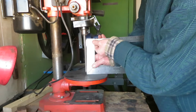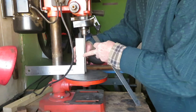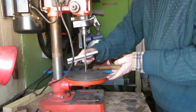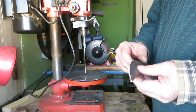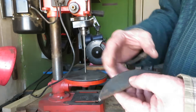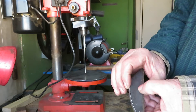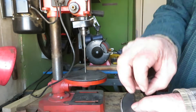We can measure it there and over here — it's 5mm. That's what we need to lift this up to get it perfectly square. That distance is the material we need: 5mm thick to lift it up 5mm. We cut an arc 13cm long and about 3cm wide — wide enough to drill a hole in there so we can place a bolt there.